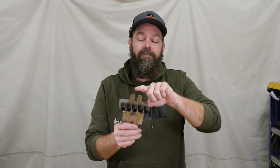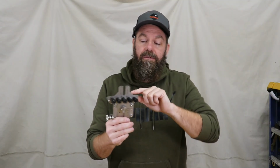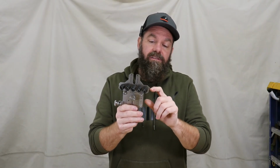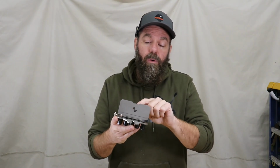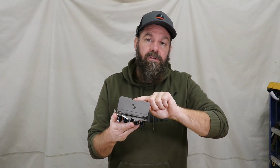And then lastly, on use, before I get to actually using this, is alignment. Both jigs have the slot for using the alignment pins. They annotate all your distances on the face of the jig, but the stainless steel jig adds these little centering notches for the dowels themselves, and they've improved the way you get a centerline reference on the fence. For alignment, I have to give the nod again to the stainless steel jig.